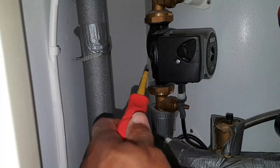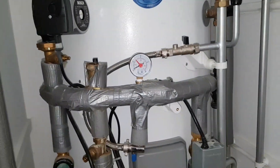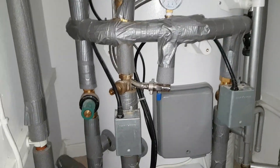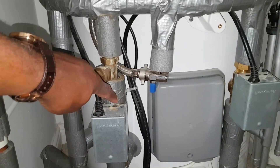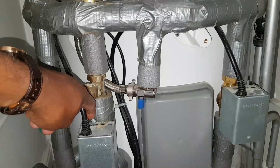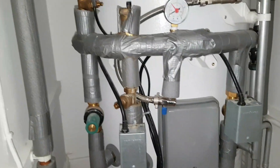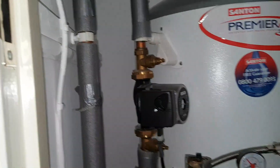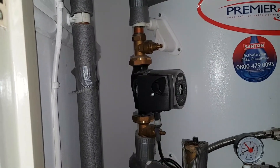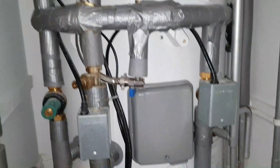Look at the pump arrow — it's going towards the motorized valves, and then you trace it from there. The next thing is this manual lever here — see if we can move that across. There's resistance on it, so that means it's closed. We also notice there's no pump activation — the pump's quiet, so it's not being energized. There's no demand, and as I said it could be the cylinder thermostat.